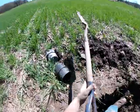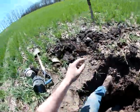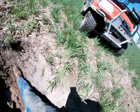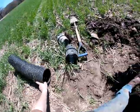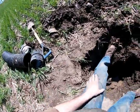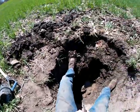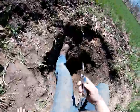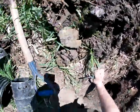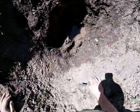He's lucky we found all the stuff we need here and didn't have to run to the guy that does all our tiling work and go get some off of him. We've got our own real old tile plow and tile carts, but we haven't used them in a while. And this is that laying by the tile cart. I'm gonna just take my Leatherman, cut out the bad chunk of pipe, and we'll splice in the new.